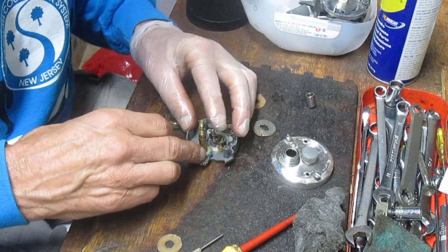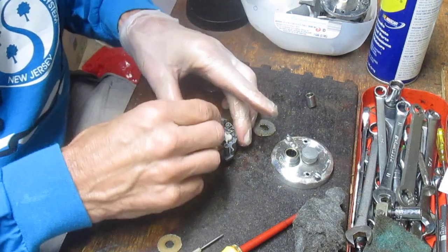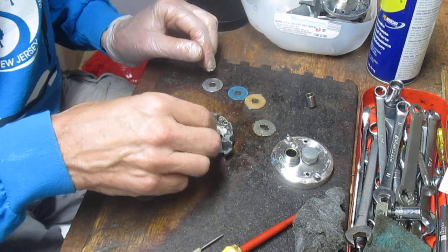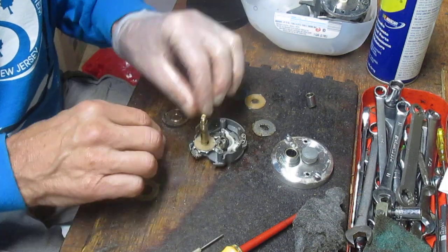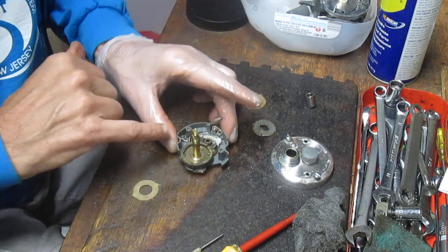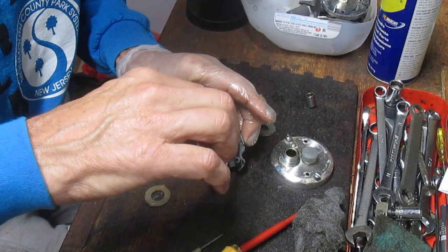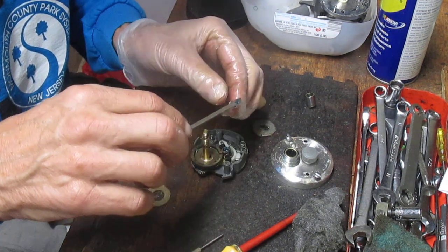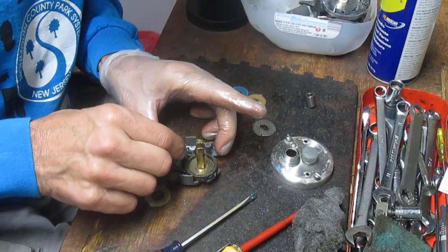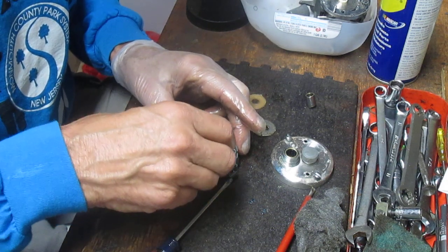Sometimes it's just a visual sighting. We got that one. Then we have the bottom one that rides the main gear, then we have the main drive gear — we're going to set this in now. I'm going to make sure it meshes with the spool gear and put a little bit of grease on that spool gear. Since it hasn't had grease in a while, I'm going to lay a little bit on the outside teeth of the main gear as well. The springs came off here — if you got lost in the process, grab that schematic and it'll tell you where it goes.